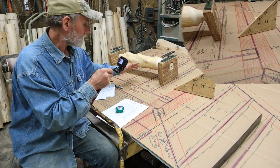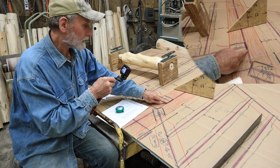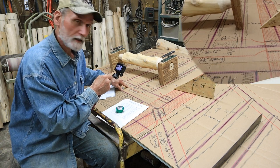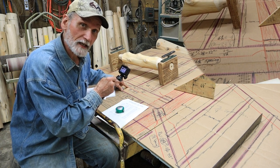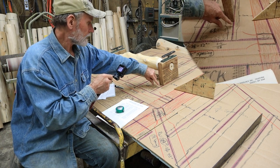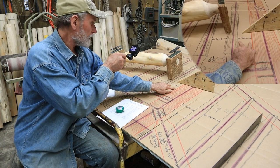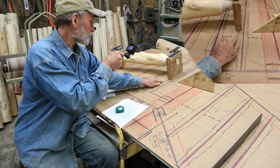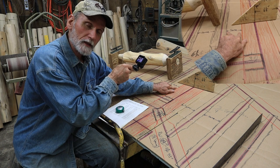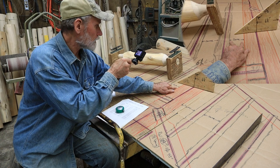And we go, well, we got to make up for that. Here, we'll back up just a little bit. Center on this section of rail, center of one post to the center of the next post on this section is 55.5 inches. So if we take, and where we have here, to have the same space between the spindle and between the spindle and the post, to match up with code, we need to be 4 inches or less to match up with residential code.